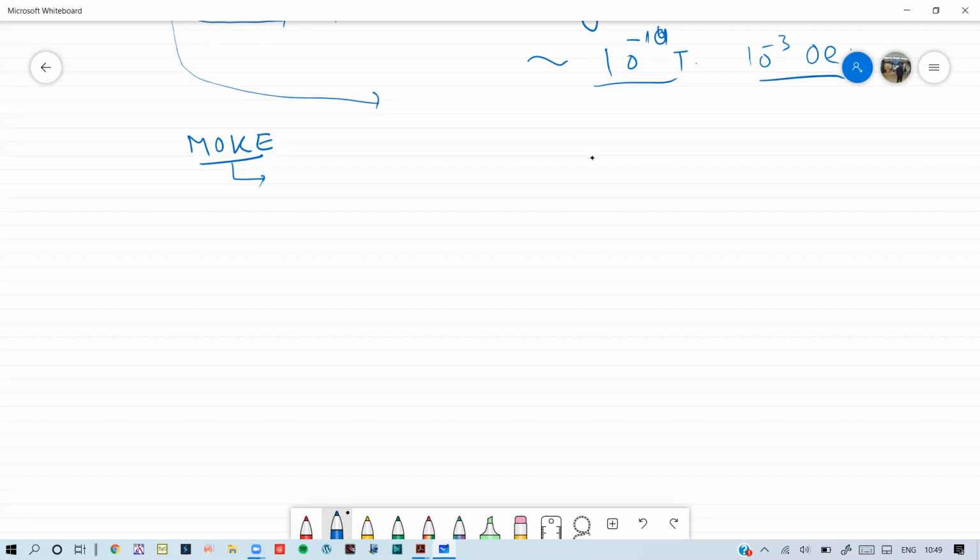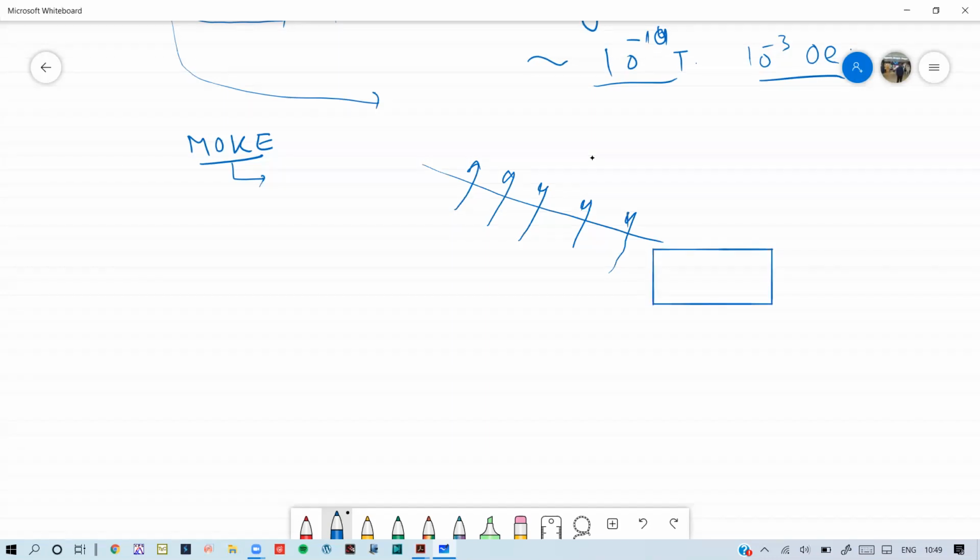And that magnetic component has a magnetic moment, and for example, if this is a magnetic vector, it interacts with some material, which has magnetic domains here. These magnetic domains are magnetic moments, so it will interact with these. Because this is simply a magnetic field here, H or B, mu naught H, and it interacts with the magnetic moment of this sample, and it will try to align these. And you detect the change in the output, where there is a detector.